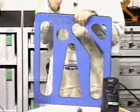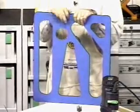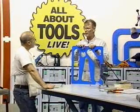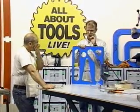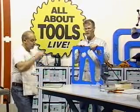A plug repair is typically used to repair an area where you've had severe impact damage, perhaps some chemical staining. I remember one job we did, some people had got a commercial grade of acetone on top and it dissolved the acrylic. When you're looking to repair a small spot, a plug is great and simple.